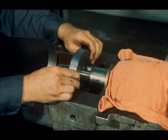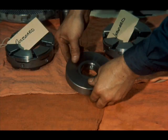With the lock nut off, the thrust collar may now be removed from the shaft. Usually on bearings of this size, the thrust collar may simply be slipped off the shaft manually. On larger bearings, threaded holes are sometimes provided in the thrust collar to permit use of a puller in removing the collar from the shaft. Place the thrust collar in the protected area and be sure that nothing is placed on top of it which might scar the thrust shoe bearing surface or the surface which mates with either the lock nut or the shaft adjusting shim. A nick or burr in either of these areas will cause trouble during reassembly.